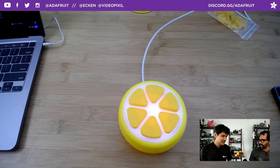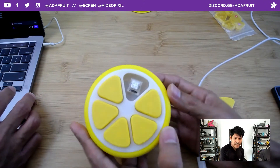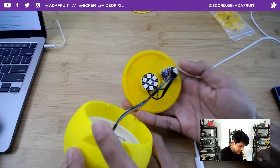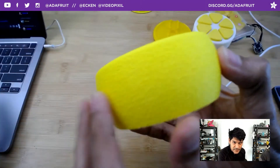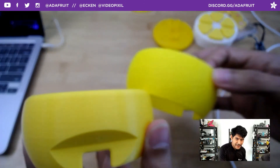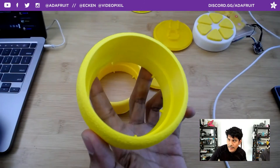On Adafruit, the Ruiz brothers show how they were able to create this lemon-shaped mechanical keypad. It's a 3D printed macro keypad shaped like a lemon, lime, orange, or your citrus of choice. Under each slice is a Cherry MX style mechanical switch wired up to the latest Adafruit QT Py board, which can act as an HID device over USB. There's also a small NeoPixel jewel to give it a nice glow. The code is all done in CircuitPython. What really caught my eye was the 3D printed enclosure — aside from being cute and snapping together without any hardware, there's a cool technique to give it a fuzzy texture using a feature inside of Cura called Fuzzy Skin. It's all done in the slicer, so it's not a texture you have to model. For the right project, it's a cool way to conceal layer lines, with control over whether the effect is applied on the interior or exterior perimeter. If you're going for something organic-looking, this seems like a great option.